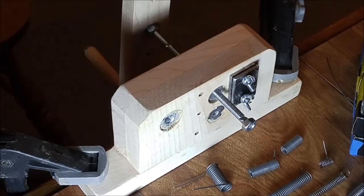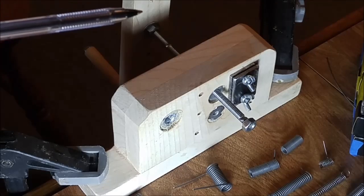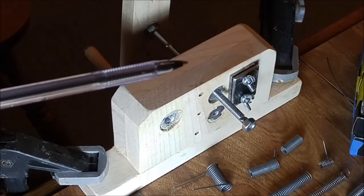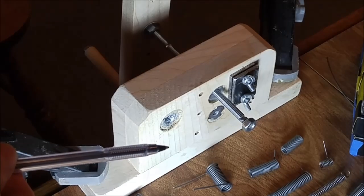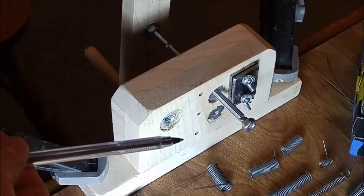This jig is made from scrap three-quarter inch thick wood — almost any type of wood could be used, including plywood. The jig clamps down to the workbench here and here. There's a crank handle at the back of the jig that has a bolt attached to it running through T-nuts on the jig. This bolt is the mandrel that the spring wire wraps around. The jig is set up for three different sized bolts, and the bolt used determines the coil spring's diameter and pitch. A quarter inch bolt is installed right now, and almost any bolt size could be added.